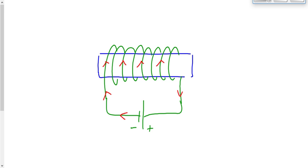Now, stick your fingers — your left fingers, because we're talking about electron current. Remember, we briefly talked about conventional current, the flow of positive charge, but we're talking about electron current here, so we use the left hand. Remember, it's the opposite of the wire grasp though. The coil rule says instead of thumb in the direction of the current, my fingers are going to go in the direction of the current. So my fingers are going to point up in the front.